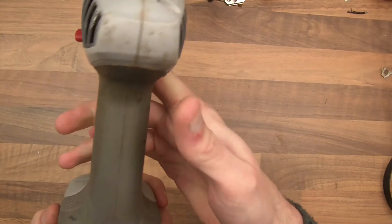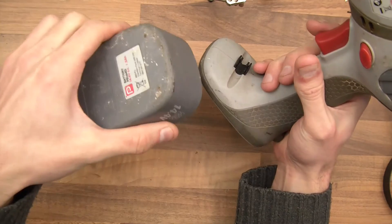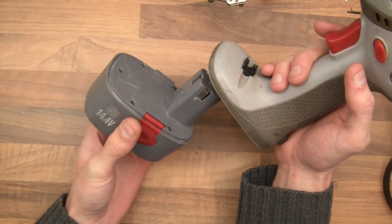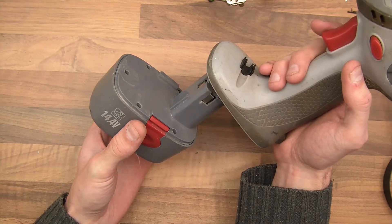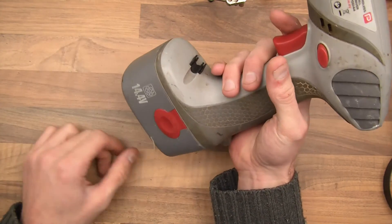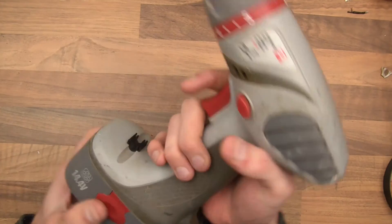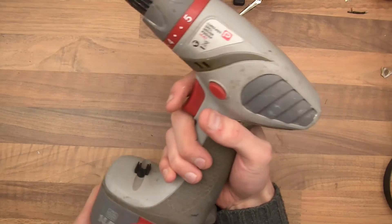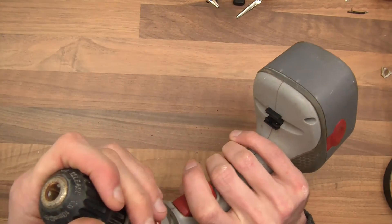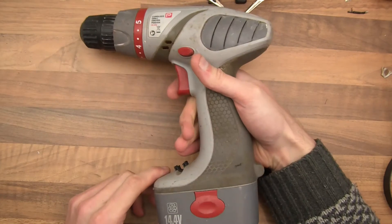When it comes to charging it up — if I remember rightly there was a charger where I plug it into something and charge it up. Now that's going to be different, of course, because it's lithium-ion. You charge lithium-ion at 4.2 volts per cell, and there are four cells, so that would be 16.8 volts fully charged. You'd charge at constant current — probably about one or two amps, depending on the capacity of the cells. But there you go — a very cheap battery driver, saved me quite a lot of money, because I would have just bought a new one. I hope you enjoyed the video — thank you for watching. Bye.